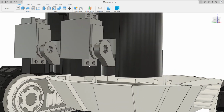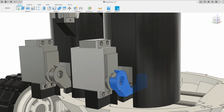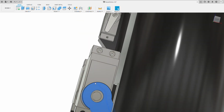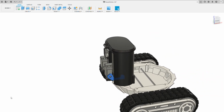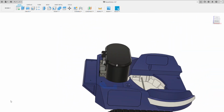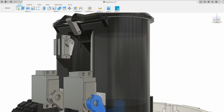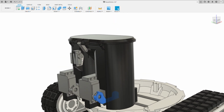And then what you've got here is the actual can lift arms that again glue onto a standard servo horn. The ones that have got both sides, you want to trim them off at that side because there's not a lot of room behind when you bring in that main body. If you stick the servo horn out, there's no room. So cut the servo horn off with a pair of clippers. As always, centralize your servos. Make sure you know where it's going to be on its low point, its upper point. You are running these off RC, so you want 1,000 to 2,000.